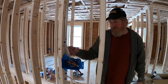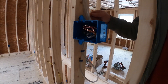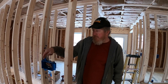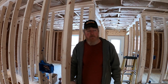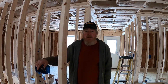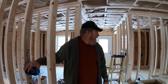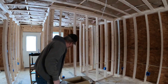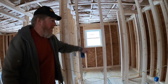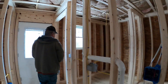On this box you'll see we went past it and looped back up into it. I always bring my power wires into the bottom of the switch box and my light wires into the top. In this case there are two wires because we have a fan, a light, and some recessed cans, and power comes in the bottom. That way when you come back a year later after painters have sprayed the walls you're not trying to remember what you were thinking.